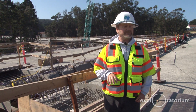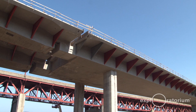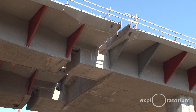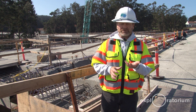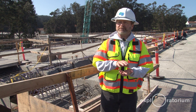The hinge is much more complicated. One of the main functions at the hinge is to provide for independent movement between the two frames. You have a long span and a short span that sit on top of each other. Part of that support system is a spherical bearing — a relatively new seismic bearing — where you have a convex surface on the bottom and a concave surface on top, fitted together with a Teflon-type surface, which allows the frames to move pretty much in three dimensions.